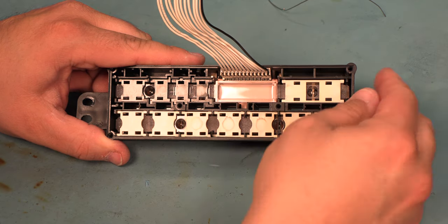We give you enough filter material so that if you make a mistake, there's plenty left over. It's fairly common for the heavy solenoids to fracture the solder joints on the bottom of the circuit board. So we're just going to heat those up. Add a small amount of fresh solder. And go on to the next one.